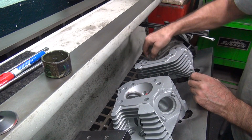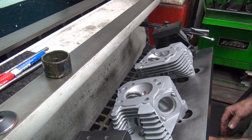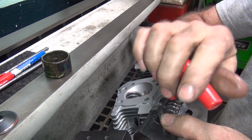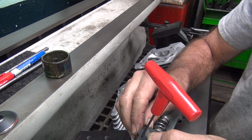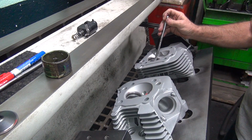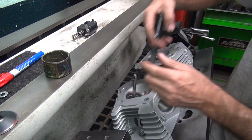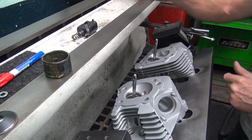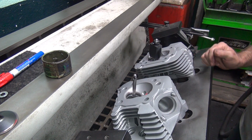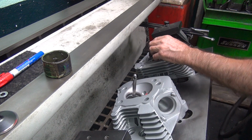Alright. Have to move it in a little bit more. Where'd my cutter go? I thought I moved enough the first time, but I guess not. Move it again. Sinking the valves a little bit like we're doing is not hurting much because with the big cam we need a little more TD clearance. We got those real high TD lift numbers, 200 and 210. We need to be a little bit lower anyway. So we're good in that respect.